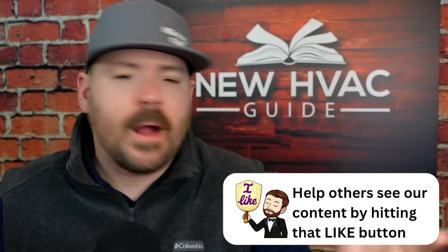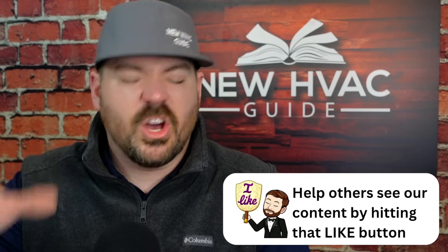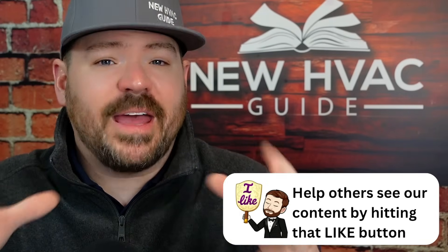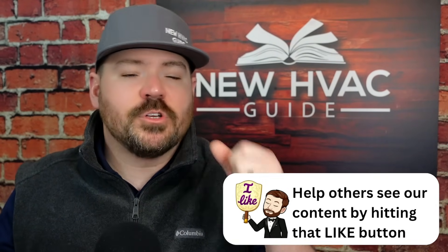There's no one-size-fits-all here. I've seen some systems that have a big problem with the return side of the evaporator coil. I've seen some with a huge problem with the primary drain pan — you clean it out, come back a few months later, and there it is again. I've seen buildup on the fan wheel that just keeps coming back. If you're installing that light before the evaporator coil but your problem is later on in the air handler or furnace, you're not attacking the problem. Install it where it will resolve the issue.